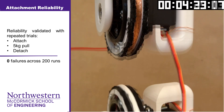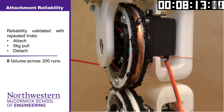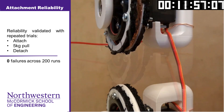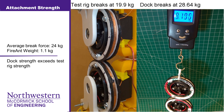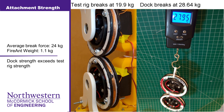We tested the strength and reliability of these docks using a custom test rig to attach and detach the docks, verifying that each connection was able to support a 5 kg tensile load. We saw zero failures across two 100-trial validation tests. We then pulled the docks until breakage and found an average break load of 23.9 kg.